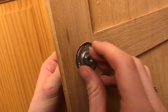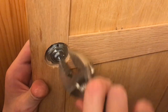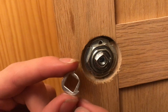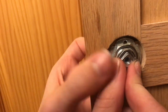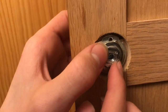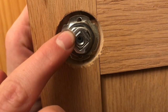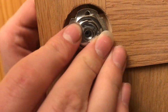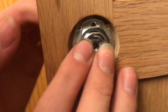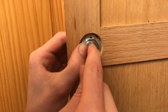Now we'll put the back plate in place — the dots on the top and bottom have to be straight up and down. This little washer that goes on before the lock piece really decides how far you're able to turn the lock. This little nib catches on it; you can see it stops it one way, and then spinning it the other way stops it there — that allows a quarter turn. The other washer is a half turn, so it goes 180 degrees, and the other is 90 degrees.